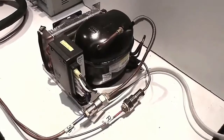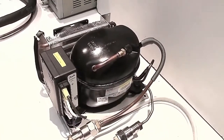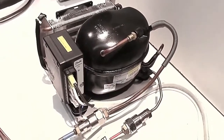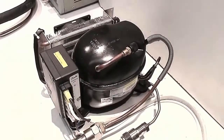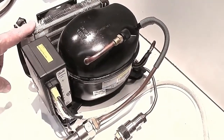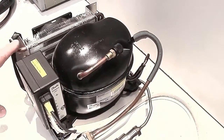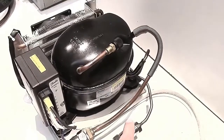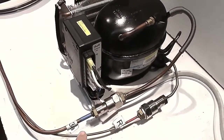This is our little air-cooled condensing unit — very simple, very basic, not one that's available in the US. The suction gas comes back into the compressor where it's compressed up into a high-pressure hot gas that goes off to the air-cooled condenser, but it could be water-cooled or keel-cooled. From there it's condensed down into a liquid and comes out on this thin tube here, now liquid at hopefully room temperature.